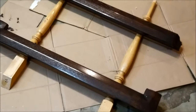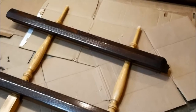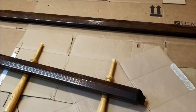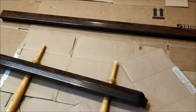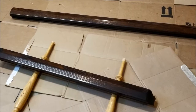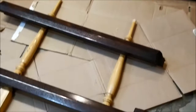The stain manufacturer recommends you wait 72 hours before putting polyurethane on. So I had to stain all these railings and top caps first, wait about three days, then put the polyurethane on. The polyurethane manufacturer says you can put two coats on in 24 hours, then wait 24 hours, sand it, and put another couple of coats the next day. Even if you have things spaced out perfectly, you're looking at about five days minimum, or about a week.